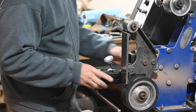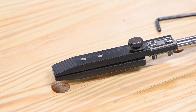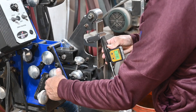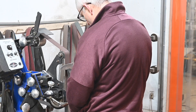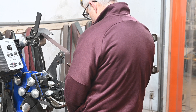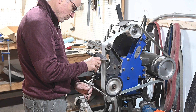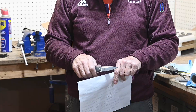How time efficient is this process? There are people who love sitting around sharpening knives — I'm not one of them. If you're just going to sharpen one pocket knife, it's a moderate pain setting this thing up. You've got to set the tracking for reverse, gauge your angle, change belts, fiddle with the tool rest arm — could take 10 or 15 minutes for one knife. That's not a massive improvement over doing it by hand on an Arkansas stone. The first advantage, though, is that no particular skill is involved. Plus, when you're done, it really is crazy sharp each and every time if you follow through the whole process carefully. So I do actually sharpen kitchen knives and pocket knives on a one-off basis sometimes, and even with the time-consuming setup, the results make it worth the effort.